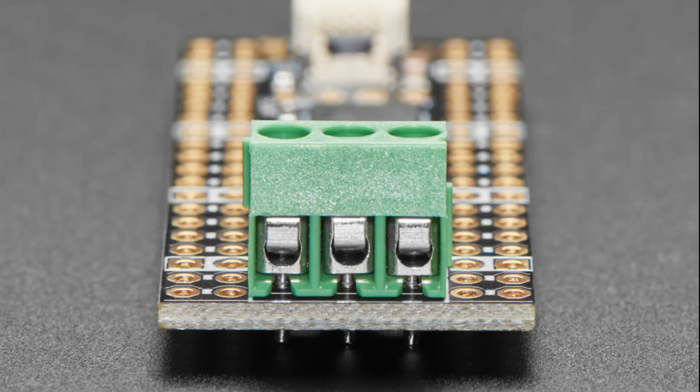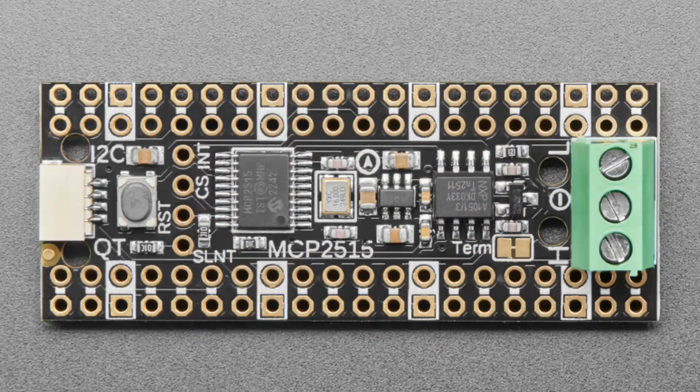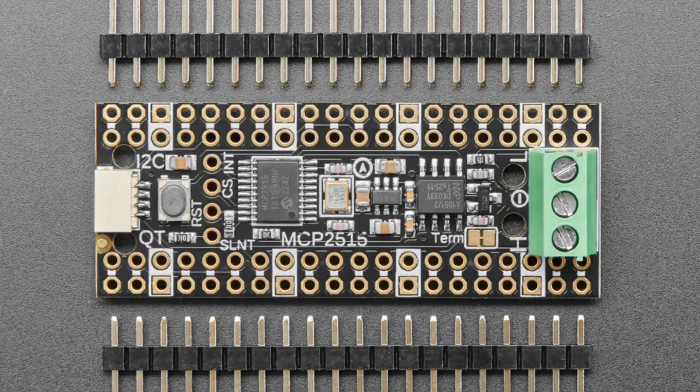We've made sure all our cowbells don't have intersecting pin numbers so you can stack them up with stacking headers freely. This comes with a terminal block ready to go, with low and high CAN signals and ground in the center. We also added a STEMMA QT port so if you want a sensor system using CAN and want to plug in STEMMA QT sensors, it's very easy. It works with both the Pico W and the original Pico. It comes with plain headers, but we recommend checking whether you want stacking or socket headers depending on whether you want the Pico on top or bottom.